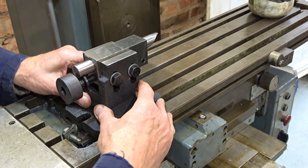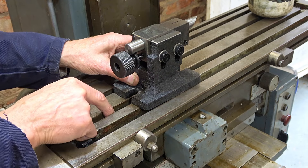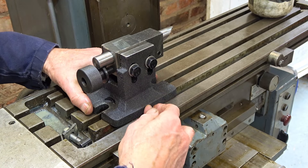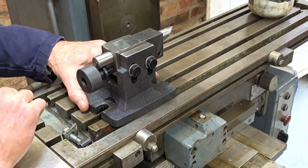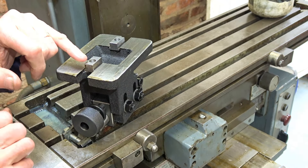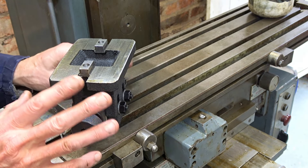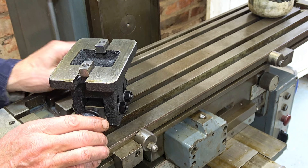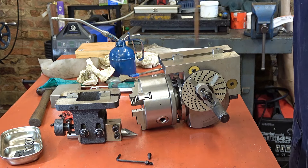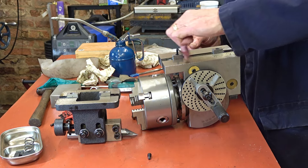There's a little bit of play — as I said I would have made those keys a little bit wider, but I was more concerned about making them too tight and having them jam. I'll just need to push it over a bit before clamping if I'm even that concerned about the tram — it'll still save me a lot of time. I finished it off with a file on the hacksawed end and put some chamfers on. When I cut the keys for the vice I'll make them that little bit wider, and that might be a video coming soon — but I can't promise you the exploding slitting saw experience.